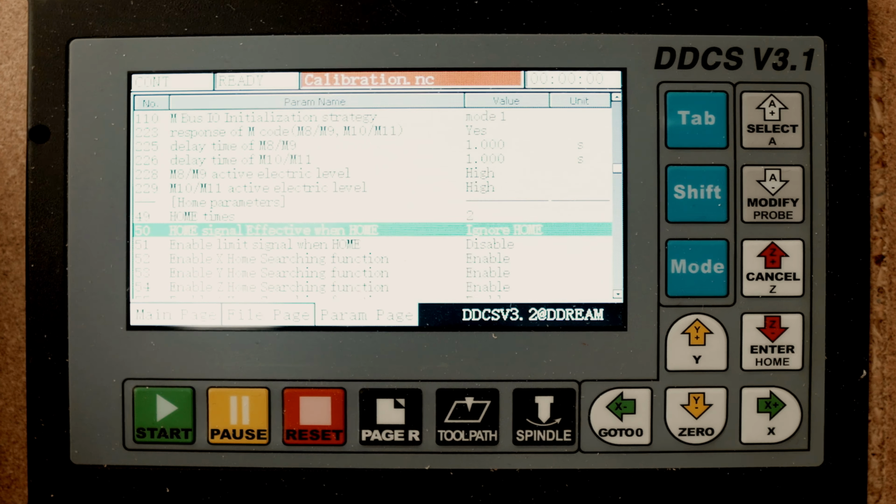That's a home speed. And here, let me see. So here we come to the probe, and I would advise you to set this to mode 2, because if you choose probing, then there is as a matter of fact three different selections you can do: only to probe on a set axis, to probe on one of the other axis, or make a full automatic probe. And normally it is in 1, so you will only probe the set axis. But I already entered it.